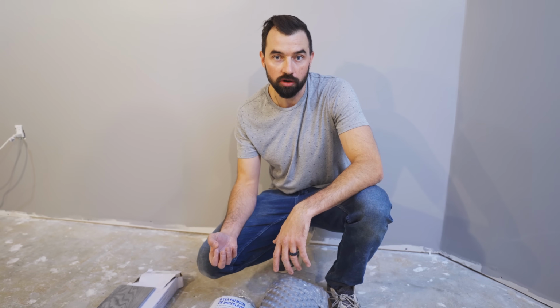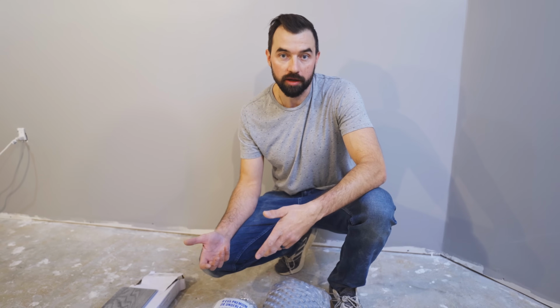In today's video, I'm going to show you how to install laminate vinyl plank flooring in your basement the right way. The key thing you need to consider is that when you're working in a basement, you're probably installing the flooring over top of a concrete base. The thing to worry about there is that your concrete is porous and over time it's going to suck moisture out from the ground beneath it into your living space above it. And you're going to want to make sure that you have appropriate materials to block out that moisture.